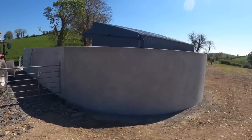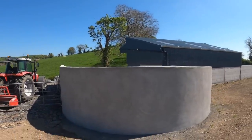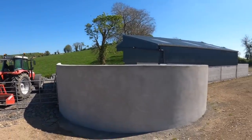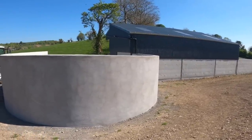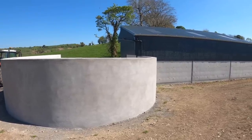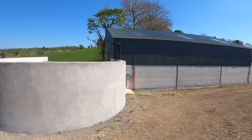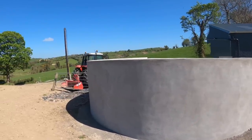As you can see, the wall is drying out nicely — very happy with it. It's in now about five or six days. We are wetting it three times a day because you don't want it drying out too fast or there's a good possibility it would crack. We've wetted it a lot now and it looks really well, it finishes off really well. I'm over the moon with how well that wall turned out. I'm very glad I did it that way.